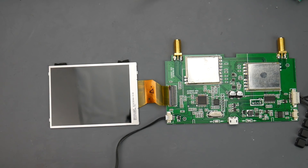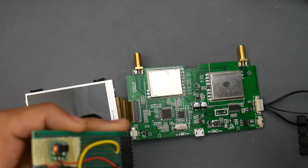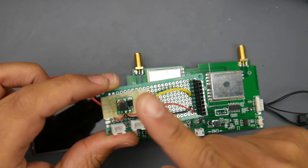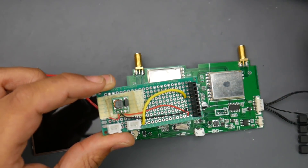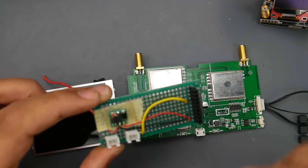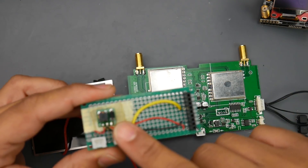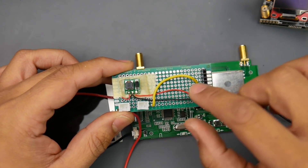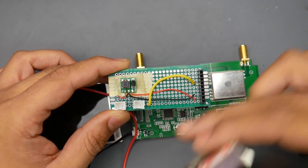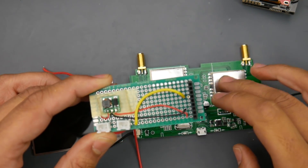Let's start modding. Before modding this, you have to watch my VR006 modding video because I created this PCB. What we're going to need is a step-up voltage converter — this will step up the battery voltage to 5 volts to power any Fat Shark module, since they take 5 volts. I'll have a timestamp for when I start making that board. This board takes the battery voltage, outputs 5 volts, and also takes a video line from the Fat Shark down to the goggles.